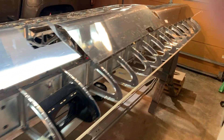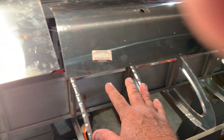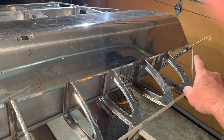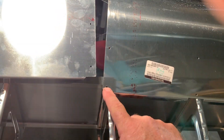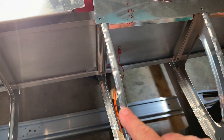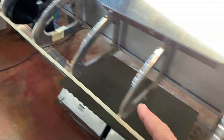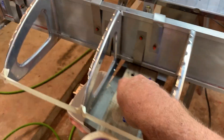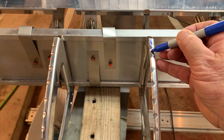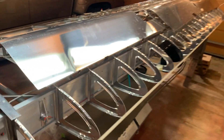Next we're going to start with the outboard rib right here. As the manual says, it should be about an inch outside this nose rib — but really what we're doing is lining it up with the pre-drilled holes, which will go over this nose rib, so that's the important thing. I'm also going to go back and mark a blue magic marker line down the center lines of all of these — top and bottom — using a ruler. Then I'll be back.